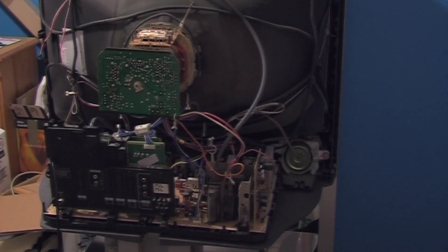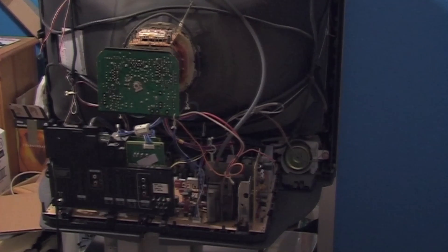Well I was hoping for a nice easy fix on this TV - no such luck. I've re-soldered all the dodgy looking solder connections on the bottom of the power supply board and tested all the resistors with a meter - they all check out fine. I think there's a problem either with one of the capacitors or one of the semiconductors on the board. Furthermore I think one of the regulator circuits has packed in because it sounds like some of the voltages have gone too high. It's crackling and the last thing I want to do is start poking around in there when it sounds like it's about to go bang. I don't think it's worth getting it professionally repaired - it's only a big old CRT, it's not high def, and because of their weight you'll pick them up for peanuts. I saw one go on eBay last week for £10.50.